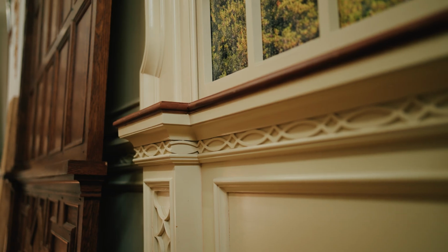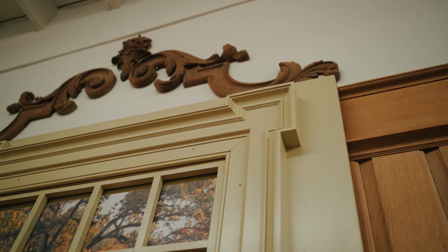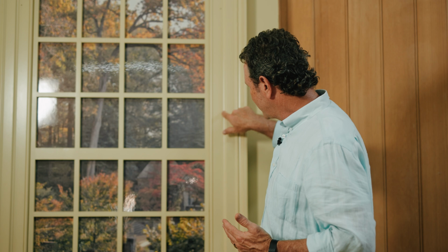But if you look at the moldings and the molding shapes, they are Federal because we've cut away. Notice we've cut away here at the backband, the tenia, we've cut away in the middle, and the bead is smaller. So each different step, each different little detail is more Federal. So it's a subtle thing, guys. It's a subtle way of communicating, but there's definitely a way to reach into the past, pull out the molding, and go, it probably came from this period.